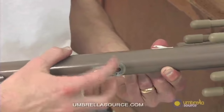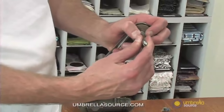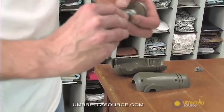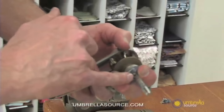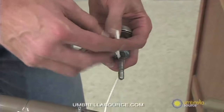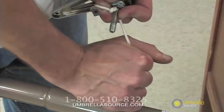Remember, this is your cotter pin assembly side and this is your crank handle assembly side. Grab your crank handle, making sure your spring is still attached. Grab your support bracket and thread that through. Make sure the eyelet is exposed — you cleaned it out a couple of steps ago. Thread the opening of your string through that eyelet on your crank handle, then tie a small knot to prevent the string from passing through the eyelet.